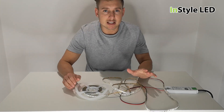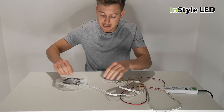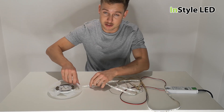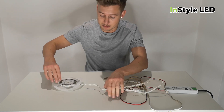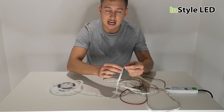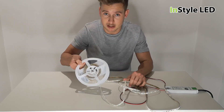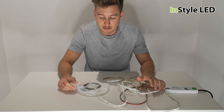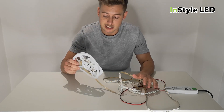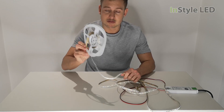That is one of the main causes of strip failure. If I fired that back up it could happen even quicker. With different wattage strips this can get a lot hotter, a lot quicker, and you'll start to see sections fail where the tape has failed due to overheating on a reel. So be aware of that if you've just bought any strips — do not test them on a reel or you could damage your strips or even cause a fire hazard.